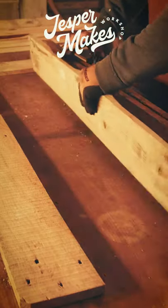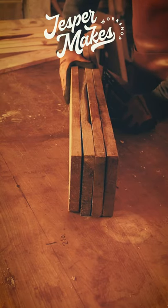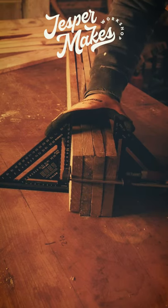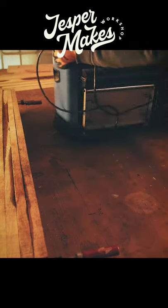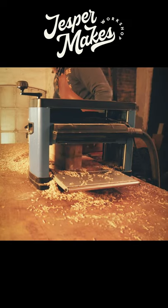I have tried many different methods for joining screw boards from pallets, however the fastest method I have come up with is this. I simply clamp five or so boards together like this and make sure they have a 90 degree angle to a flat surface. Then I run them through my desktop planer a few times on both sides until the planer has contact with all the boards.